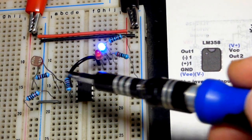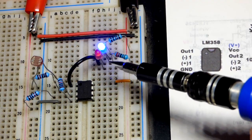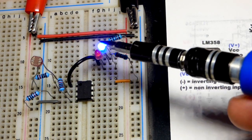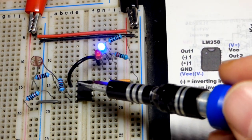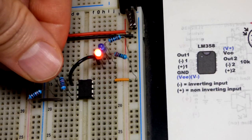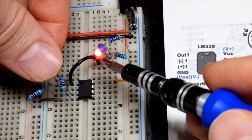You can see that wiring keeping things from being too cluttered — I've got a little jumper from the output. I got wire from my first electronics kit. Generally speaking, get a cheap kit with a breadboard to start off, then add to it over time. You can see the positive supply, blue LED lit up — they're all connected to ground. Now I'm going to get it dim enough and cover the LDR. You can see we're just barely at the point where I can drop the voltage below half the supply voltage. Now you can see the red LED is lit up.